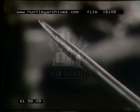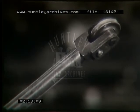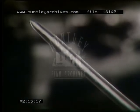But that's not quite right. As this big close-up and cross-section will show, the upper part is half-round, all right, but the bottom is not quite flat, but crowned, and this slight crown is important. The upper part for laying down the metal, the crowned underside for planishing. The second group are the beading tools, and may be wheel type, or a sharp nose tool in variations. The third group is the cutting or trimming tool, and is usually a plain diamond-shaped tool.